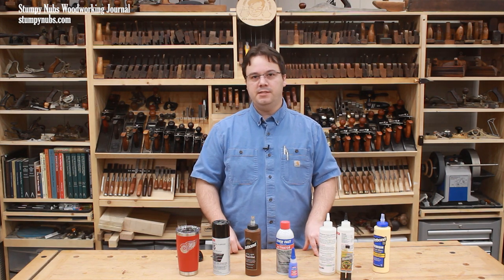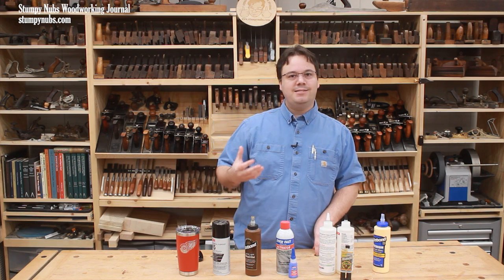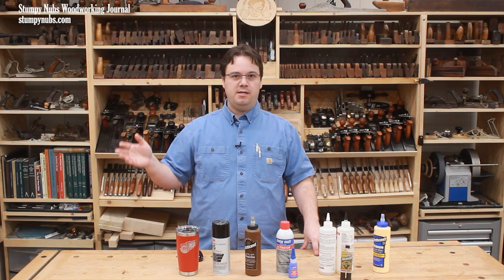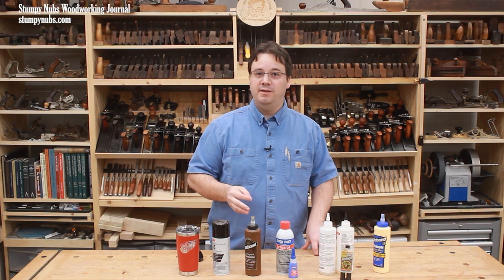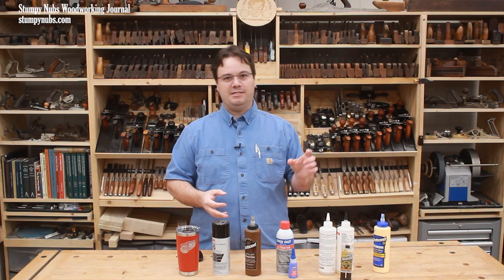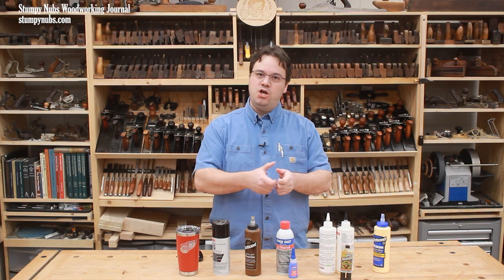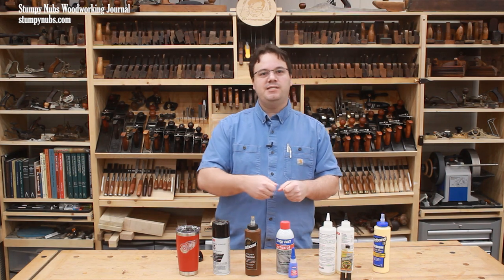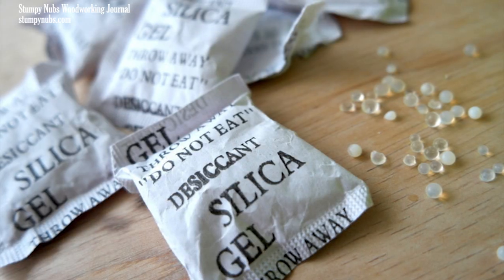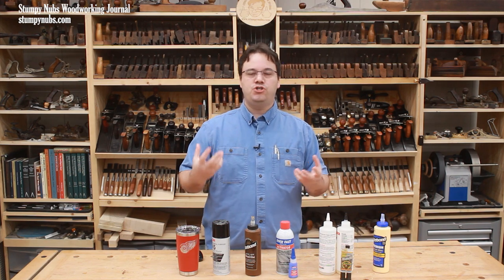So what about other common workshop adhesives? Polyurethane glue has a one-year shelf life in an unopened bottle, but as long as it remains in liquid form, it's likely to be good beyond the year. However, once you open the bottle, things can change quickly because moisture in the air will cause PU glue to harden within a relatively short period of time. I highly recommend only buying as much as you need for the project at hand. When you're done, squeeze out as much air as you can and place it in a sealed zip-lock bag or a glass jar. You might even throw in some silica packets or a handful of rice to help absorb moisture from the remaining air.